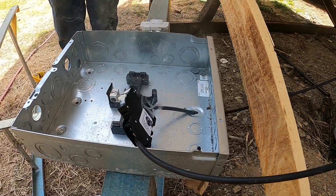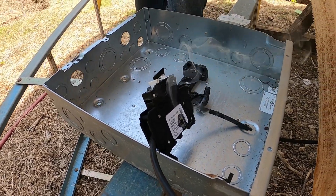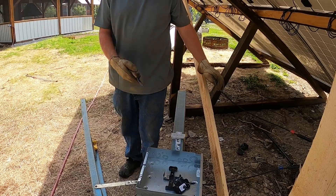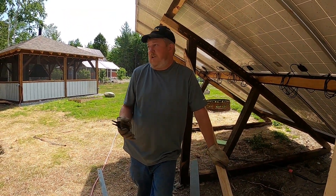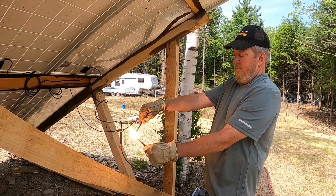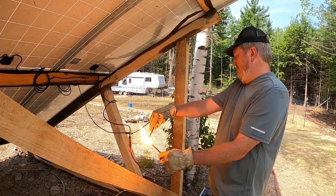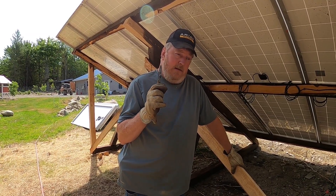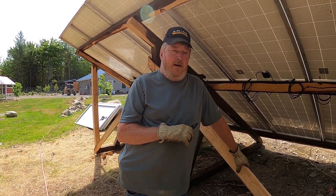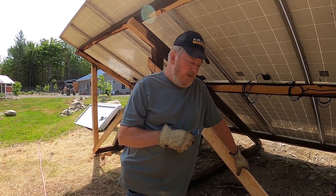What I believe happened is it actually shorted the array out and extinguished its own arc because the breaker melted internally — all melted together and just put the arc out. So that breaker actually failed in a semi-safe condition, because it shorted the array but there was no way to open the circuit. Hopefully this was kind of fun and educational — we'd never tried this on an AC breaker but we see an awful lot of them used, so we really wanted to show you the differences and why we tell you to do what we tell you to do. Thanks for watching — don't forget to like and subscribe.